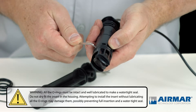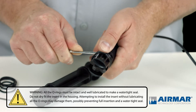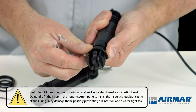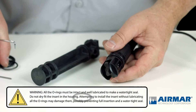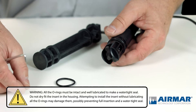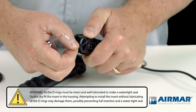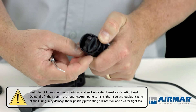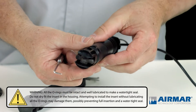I'm going to repeat the steps for the second and lowest O-ring. In this case there's only two. I'm going to remove that second one by working it out of the groove and then roll it off the sensor with my finger. I'm going to match up a new O-ring in the kit to make sure the size is relatively there, discard the old one, and being careful not to cut the O-ring on these sharp plastic tabs, I'm going to roll it into position. I've now replaced both O-rings.